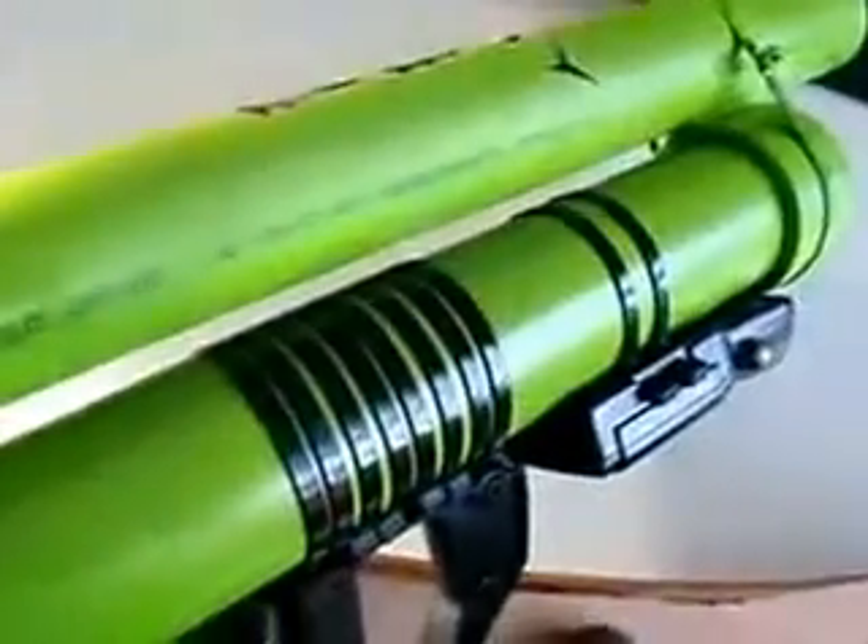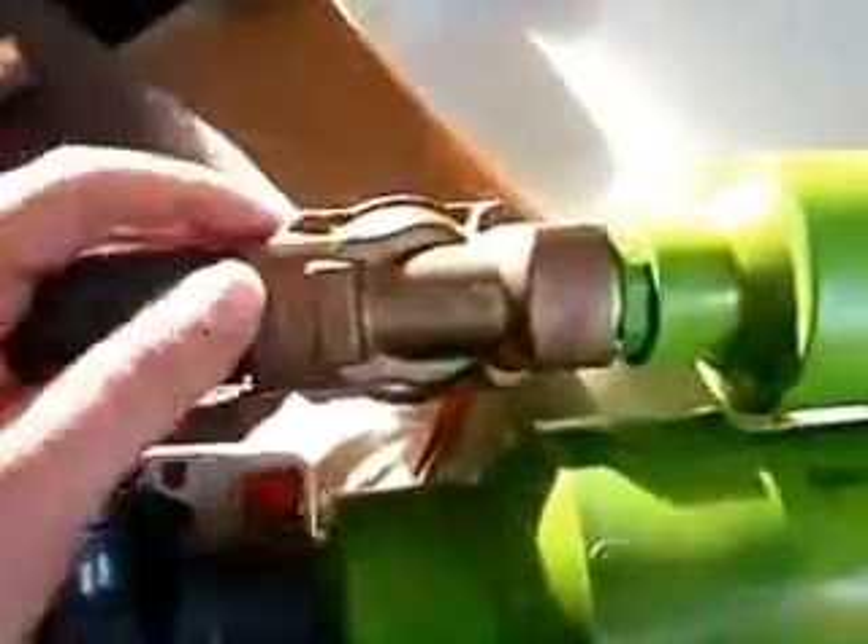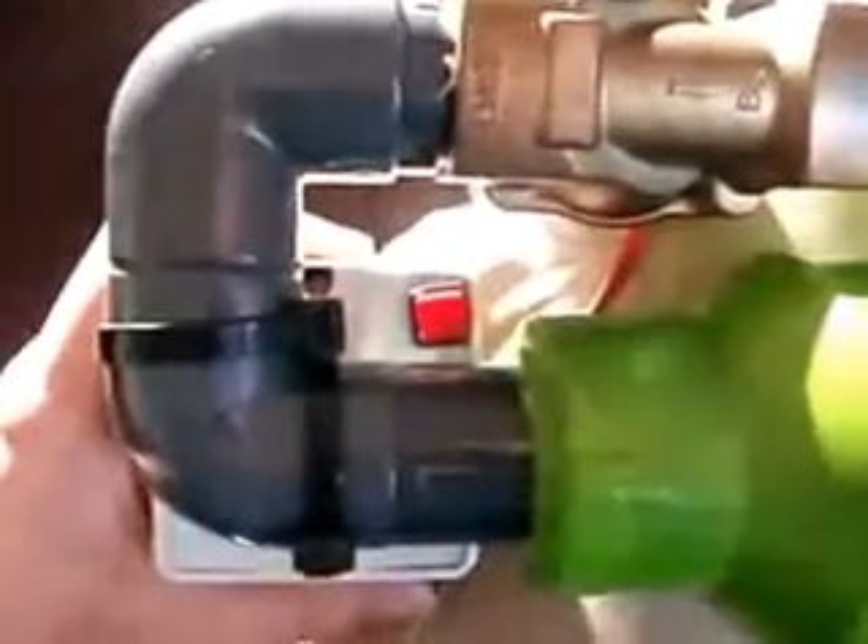It's got the batteries in it. I don't have a pressurizer right now — I'll make another video shooting it. This is basically the standard layout of any air gun: you go from your air compartment to the barrel. Normally here there would be a twist valve, but this one is electric. So what you need is a box you can put on one corner with the batteries, and a solenoid valve. These solenoid valves come in the same standard shape and sizes as your tubing — this is all millimeters, so I don't know how much it will be in inches, but you can get these in any shape and size. It's a matter of installing it: 24 volts, three 9-volt batteries, a little small box. The only thing you have to do is put the button here — and that's the main thing, so it can never go off by accident.